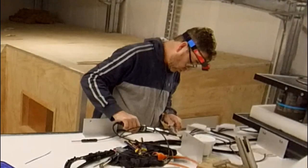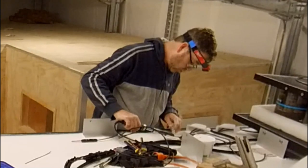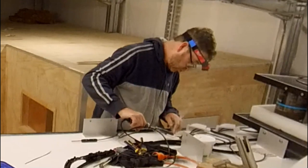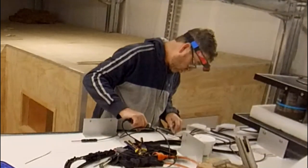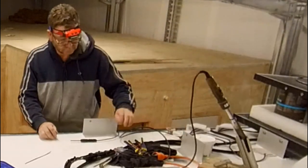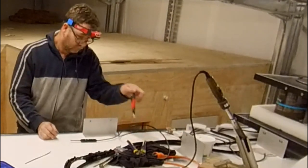Kurt made soldered connections to each panel set with plugs at the panel positions for simple disconnection if required. All panel positives were combined and all panel negatives were combined for each parallel set. Only 6 wires go back to the Victron controllers, reducing the number of penetrations.